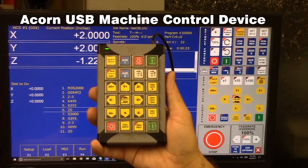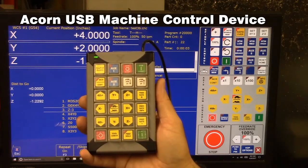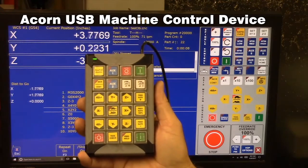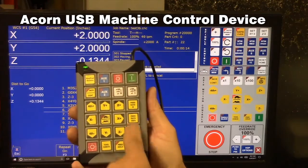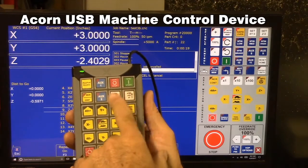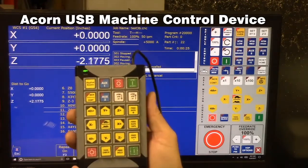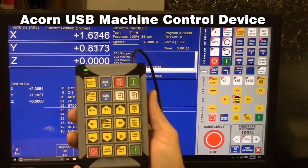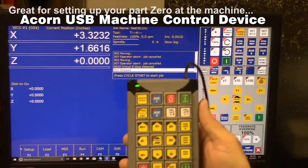We could stop it and restart the program when you hit stop. That gives you an idea of the X-keys keypad and what it's capable of doing. You can adjust your feed rates, go incremental, and change the incremental step size right here. You have programmable auxiliary keys, and you can manually start and stop the spindle from X-keys. So it's versatile — very handy when you have to set up a part. You can also incrementally jog.